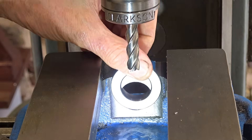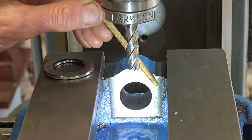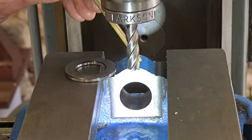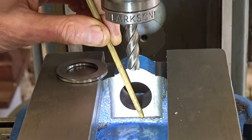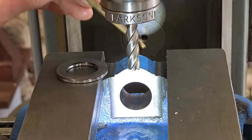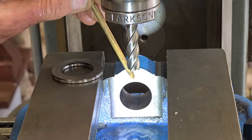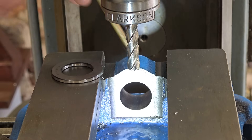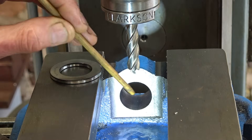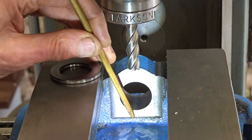This bearing is going to go there. It won't lay flat at the moment because there's a curve on either end of this boss here. So I'm going to machine these corners out so that I can get this flat — but also I need to take a bit off there. Now with this cutter, which is the longest I've got of that diameter for the Clarkson, I can't get right to the bottom. What I'm going to do is touch off on this face, move across, cut these radiuses out — really high — down to about there, as far as I can go. It'll be enough. Then I'll come back with a longer, bigger cutter, just kiss this face and machine a bit off here.